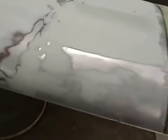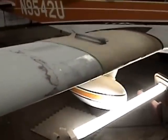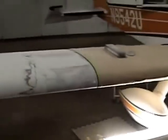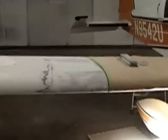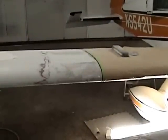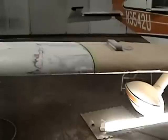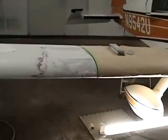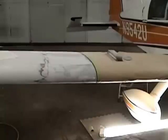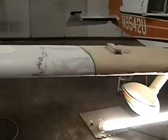And the other thing, you talked about the video that was released, the latest thing. Interesting, the stall horn didn't work. Customer said it hadn't worked for a while and he thought it was a bad switch. Turns out that at some time in past history, some mechanic disconnected it. And not only disconnected it, but he clipped all the wires off of the little electronic controller and capped them off, left everything hanging in there, and cut the power wire to the stall horn back in the loom a ways.